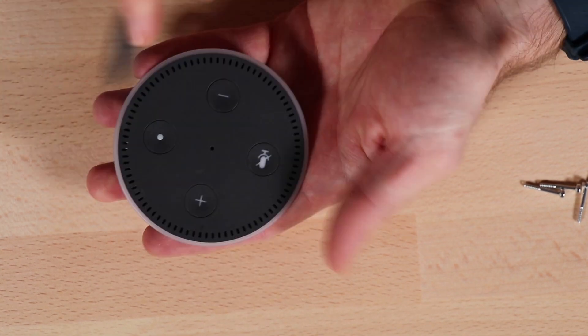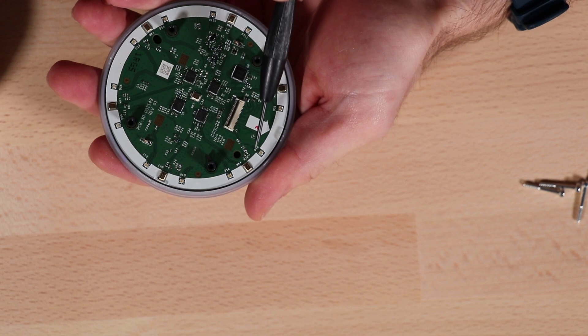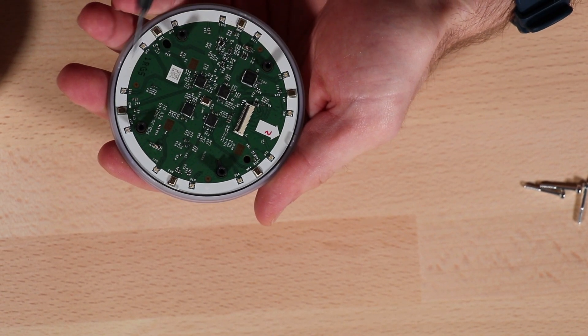Which makes sense — it aligns with the center hole. So we've taken apart a Google Home which had a two-microphone array, and they do a bunch of cool DSP stuff. Typical of Google — it's a real software-based approach. Amazon Echo has taken a real hardware-based approach. They're doing their beamforming with seven microphones. You can see the LEDs positioned next to those as well.